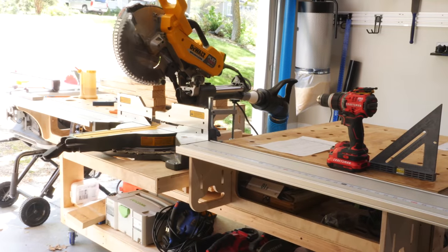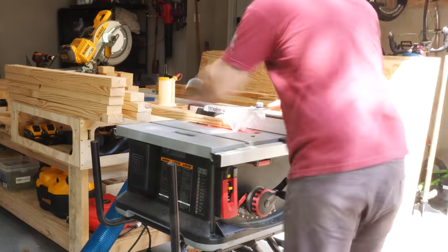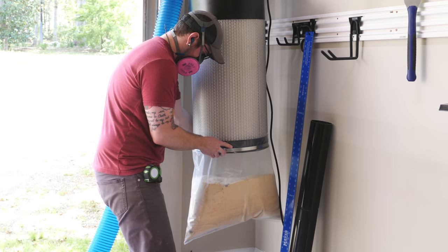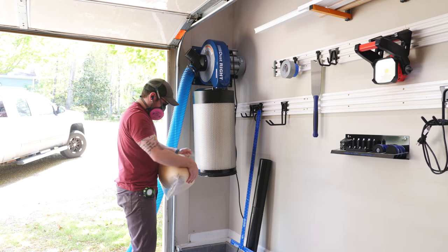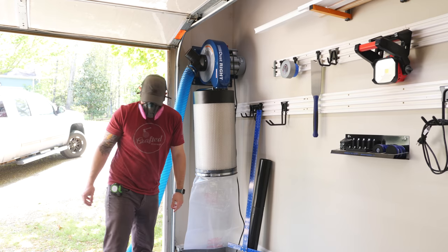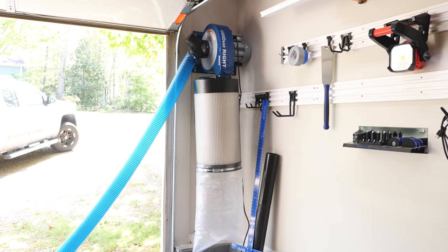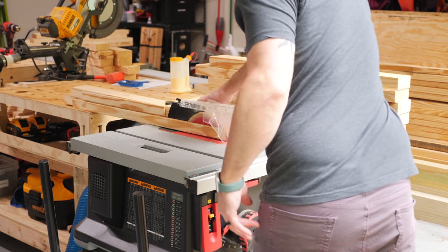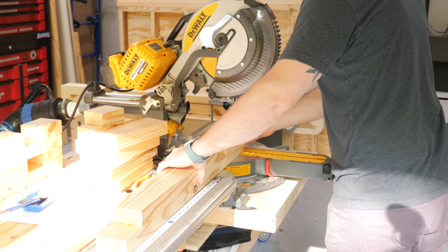While the glue dried on the legs, I went ahead and cut the stretcher pieces that would connect the legs together at the miter saw, and then I ripped them to their final width at the table saw. After all that ripping and cutting, my dust collector had definitely gotten full, and I wanted to give a quick shout-out to this new wall-mounted dust collector from Rockler. This thing is capable of pulling 1250 CFM, which is plenty for most shop tools, and this optional canister filter really does a great job of keeping the fine dust down. After the glue dried on the legs, I could trim them to final width at the table saw, and by leaving the legs oversized, I ended up with super clean edges. I also used the same trick for the bottom-most piece on the legs, so that I could trim the bottom end of the leg flush after the glue-up, which I did at the miter saw.